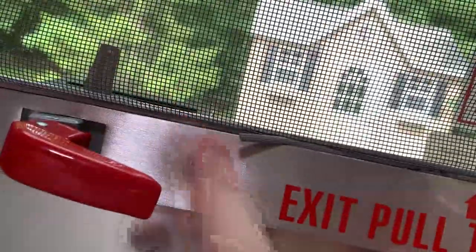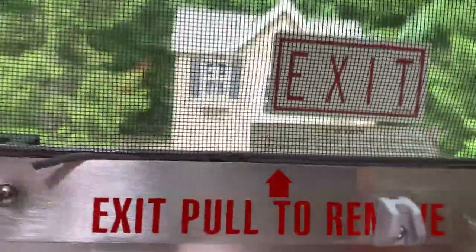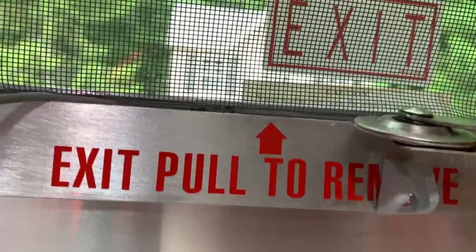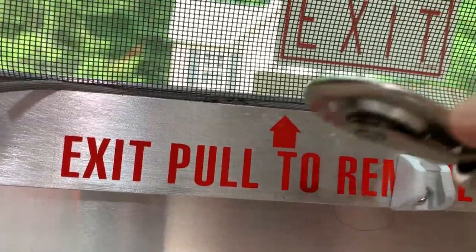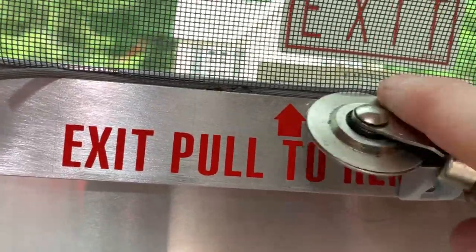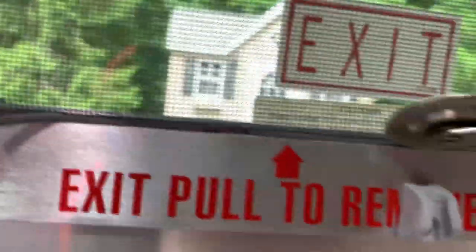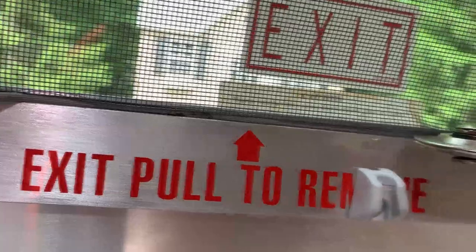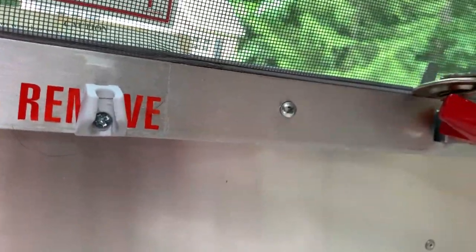I just left a little piece stuck out. Once I wound it all in and pushed it down, I went all the way back around. You have to be real careful when you're doing this that you don't push it up against the screen side, because these things — especially the metal ones — tend to cut the screen. Make sure when you're doing this that you're angled down to the bottom of the spline. It doesn't take a lot of pushing — just roll it around the screen slowly.